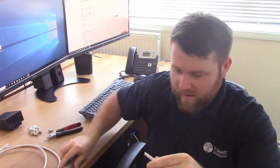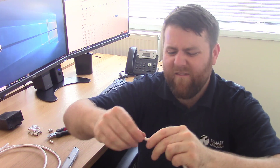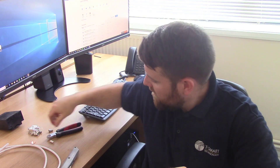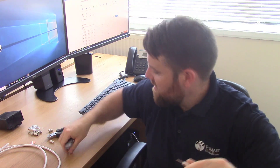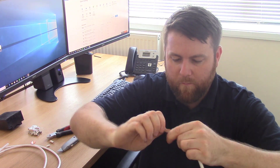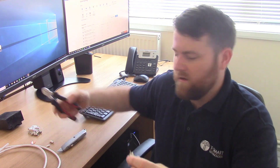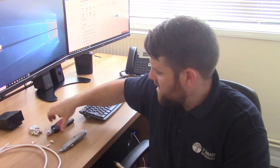I'm going to run the ring around with my cable preparation tool, removing the PVC jacket, folding back the screen, and cutting back the dielectric. Now this is just a screw-on F plug I'm putting on here. You can get crimp-on and compression ones which are a bit better, but if you put these on properly they're absolutely fine — certainly for domestic use anyway.